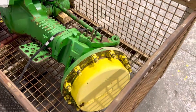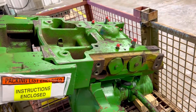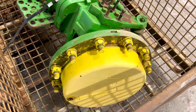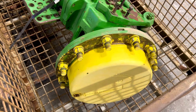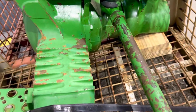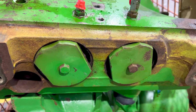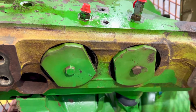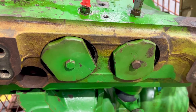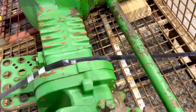We've got a John Deere 4955 front axle and steering motor. This is a conversion for a 4650 or 4850 with the ZF axle. The ZF has two steering cylinders and only one piston, whereas the late 50, 55, and 60 series have two pistons. So if you don't replace the steering motor, you get a hard-to-steer front axle.